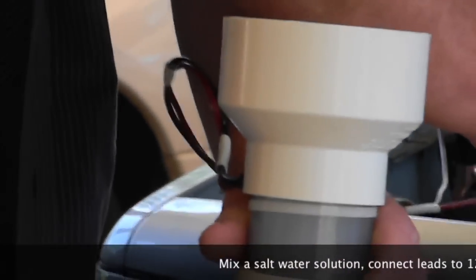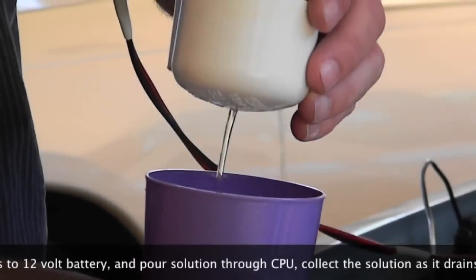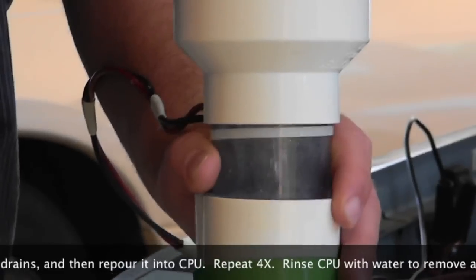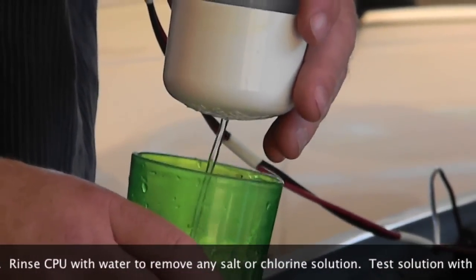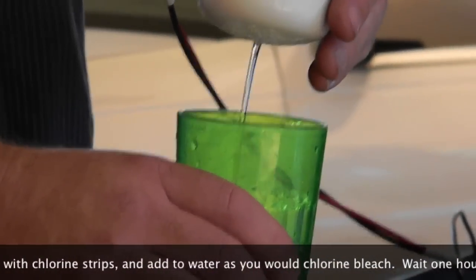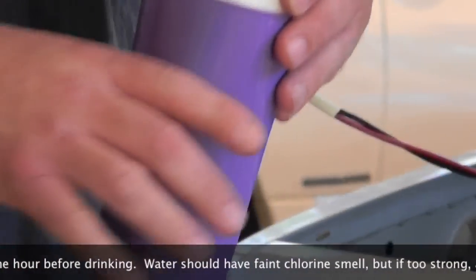See a bubble? And you just do that five times. If you were staring over here, you would smell the chlorine — it ain't bad, it's like having a pool. What's happening is the electricity running through those two titanium plates is stripping the ions off of the salt. I've taken the sodium out, so it's just chlorine in the water. It's called electrolysis, and they use it for all sorts of stuff nowadays in chemistry. After about five times or so, there's no more salt in the water.